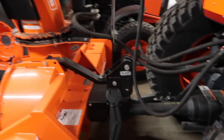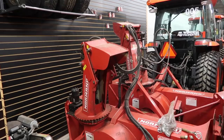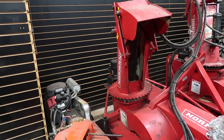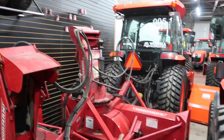Yeah, we'll look at this one at the end here. But right at the back. I'll slide down this way. See how it's just got the cutout? Mine are like that too. Well, it can slip into that notch. Oh, I've never had it slip into that. Into the cutout. And then you have to basically take a big bar and manually pop it back. What I should be doing is putting a reducer on the hydraulics so it's not going fast enough for that. Oh yeah, I noticed that one's pretty quick. But we haven't done that yet this year.